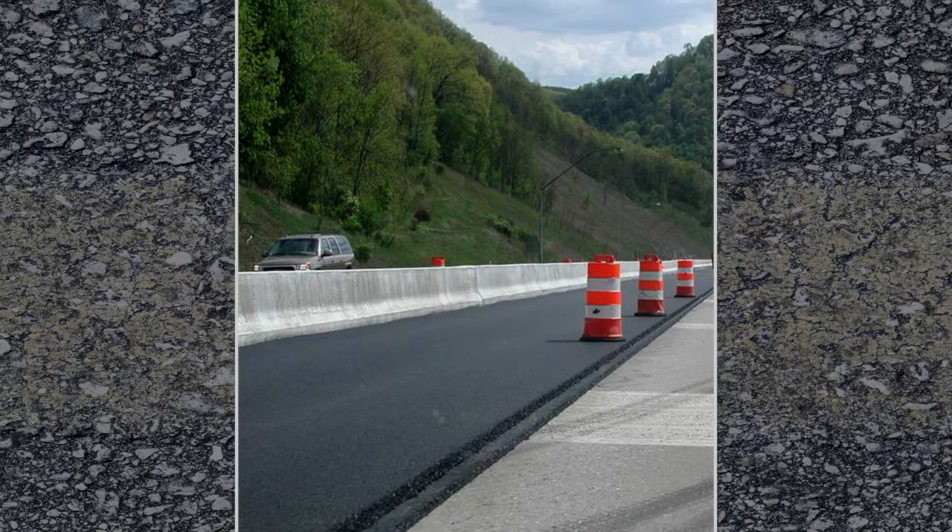The following steps are the best way to ensure the joints are well-constructed. Joint locations need to be planned in advance, especially on projects where there will be multiple pavement layers. Joints must be offset approximately six inches from the layer immediately below to avoid a plane of weakness in the pavement.